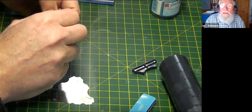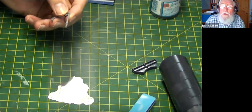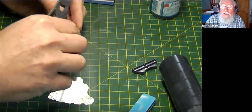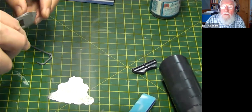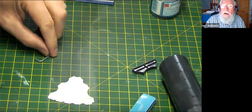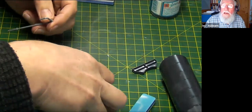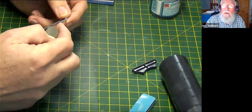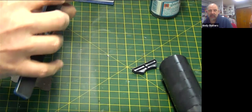My experience of that is you just have to spend a bit of time practicing the art of filing the edge of a piece. Take a reasonable file and a bit of quarter inch mild steel, just practice filing it and check how flat or level it is with a square. You have to do a bit of it with some means of measuring how well you're doing, a piece of mild steel and a medium file in your vise with a small set square. I guess holding a workpiece secure in a vise is the big help, isn't it?